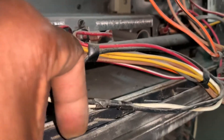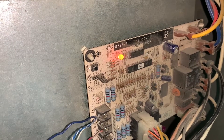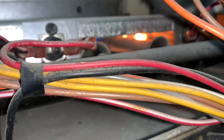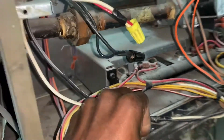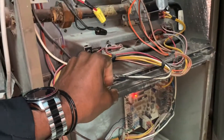It's going to go through the sequence. You're going to see it igniting — the glow igniter is glowing up. It's going to try to light, it will light, but it won't sense the flame. There you go — that's one attempt. It's going to cut back off and do this three times, then lock out and give you that seven-flash code. As you can see, that's happening because I have no flame sensor installed.